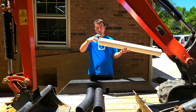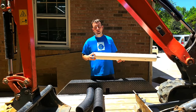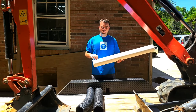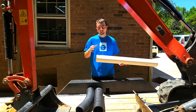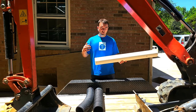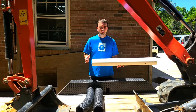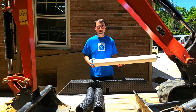When you have a crack, or the fitting cracks at the seam, now you have an opportunity for roots to come in. With PVC, you really can't isolate the cracks to just the seams where the joints are, because it all becomes kind of one piece. It's a little weaker at the joints, but it can crack at different places. So you can't really protect against root intrusion over the entire pipe — it's not practical. It's also very expensive.